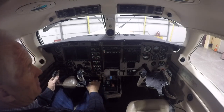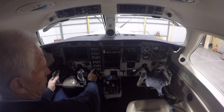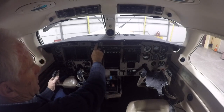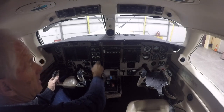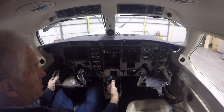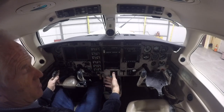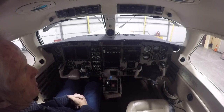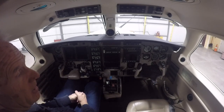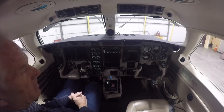Let's say that it's an odd day today. First we're going to check pump two and make sure it's delivering pressure, then we're going to turn it to pump one, make sure it's delivering pressure, and we're going to leave that pump on because we're then going to go through the ignition test and the start sequence. Any one of these pumps will keep this engine operating, so it's a lot of complexity but also a lot of redundancy.